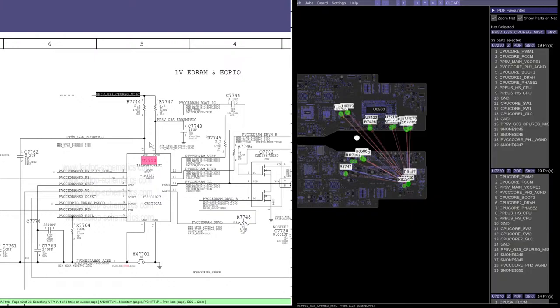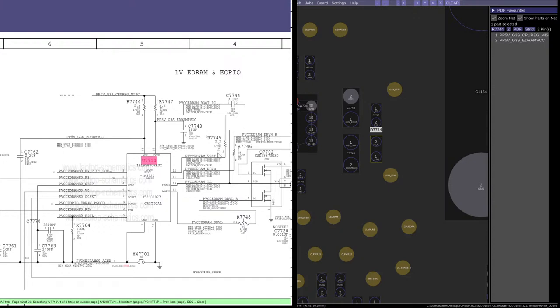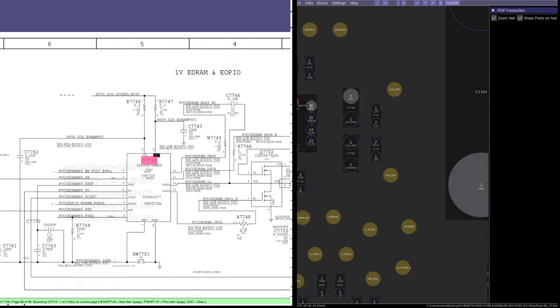Yeah, I can highlight. Okay, there. I can right-click on it and highlight. So this is what we're looking at here. The 5 volts is coming into this here. So these are shorted. Right here, past the two resistors that are right here, the input to this chip, VCC, PVCC, these are shorted. This chip has died. And it's only the chip.